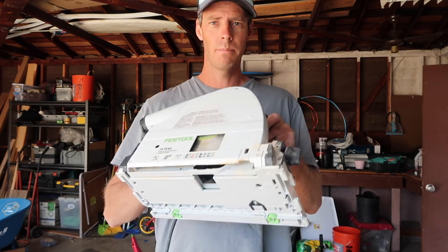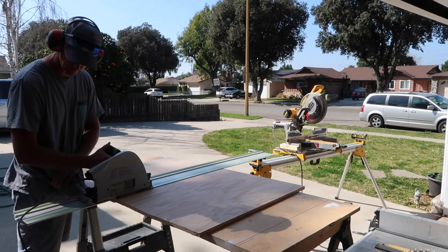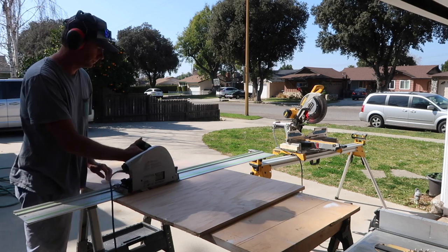The three-quarter inch plywood is going to be the bottom of the cabinet, so I'm going to cut that and then cut the sides. My track saw sits on a track and cuts a straight line — it's really good for cutting pieces of plywood. You can do it on a table saw, but it's a lot easier with a track saw. The saw moves, the plywood doesn't, so the track can be clamped on for a mitered or beveled cut.